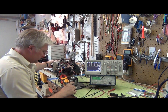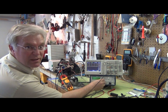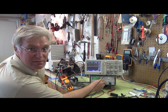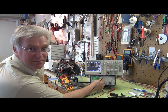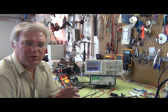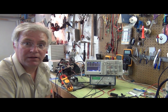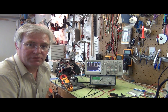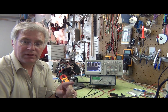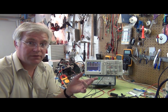Let's turn it on again and do a little duty cycle — take it up to about 50% and see how that works. I'll watch the amps on the amp meter too. Turn it up — and that's just the duty cycle on the function generator. Without a load on the motor it's pretty small — we're not actually driving a lathe with somebody cutting. I could run it like this without overheating too much. But that's it now: got to get that pulse width modulation chip working, and this should be good to go. I think I just have to replace the chip.